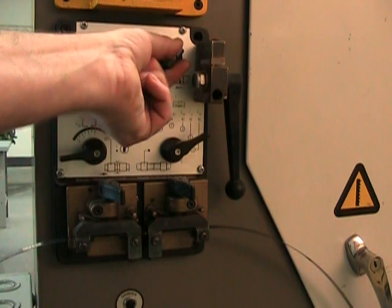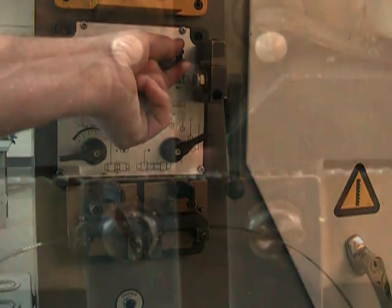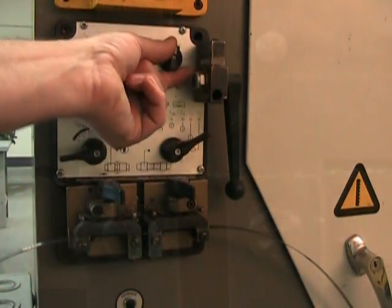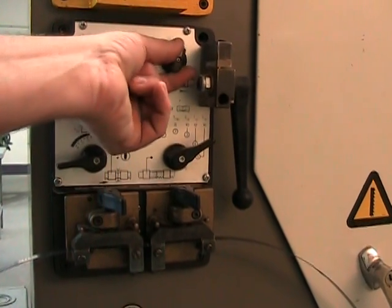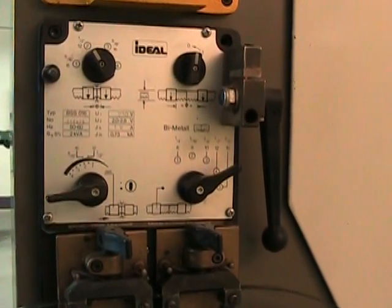So let's do it. I'm going to pulse the annealing button until I see that nice orange color. And then I'm going to continue pulsing, but this time to cool it down gradually. This heating up to a temperature that's past its critical temperature and then cooling down slowly will give us an anneal and make the blade a lot tougher.